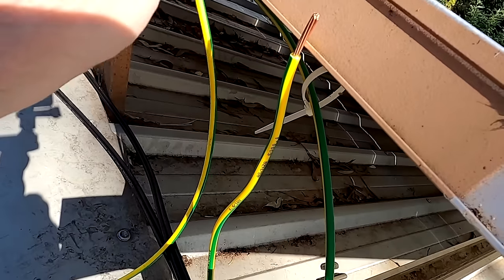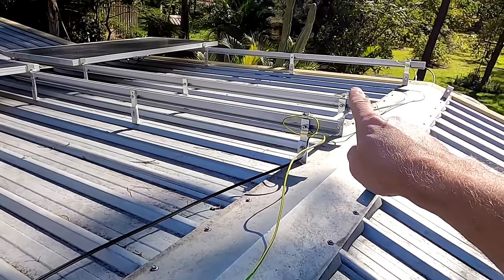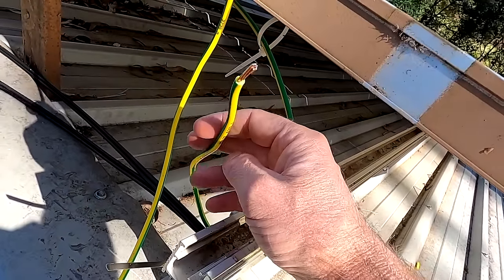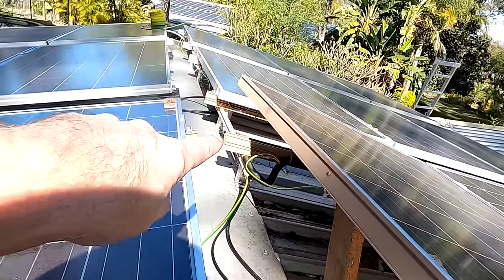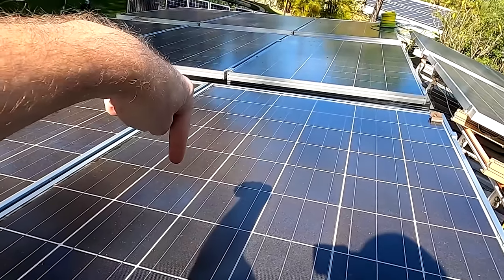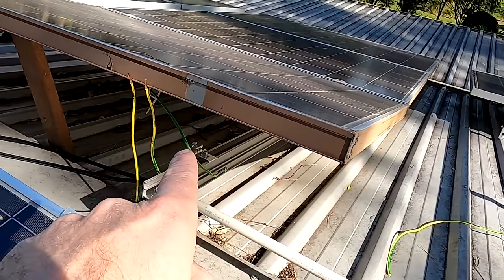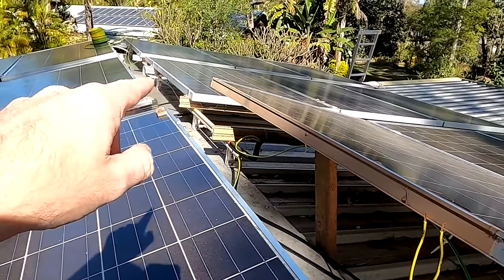Here's now the point where we have to splice these two earth cables together. So far this is all one cable and I just cut out the insulation in between where the clamp is. We have to twist them together here and put them in the clamp, and from here on it will be one cable all the way to the solar panels and then all the way down into the garage onto the main earth bar. Ideally you want to have this in one piece because this lowers your resistance. You can also splice it from one clamp to another in short pieces - that works too and is per regulations.